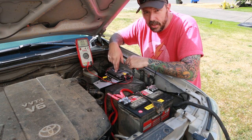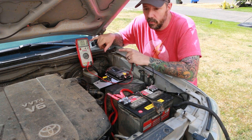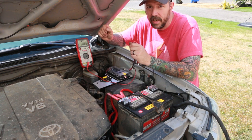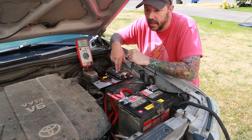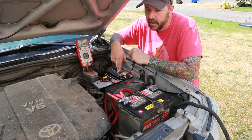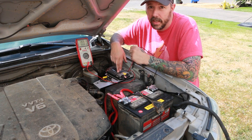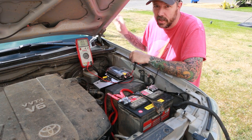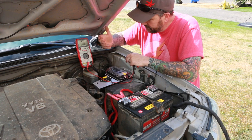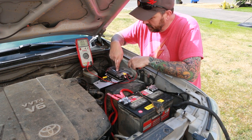I'll set up a negative switch-switching relay — that way I'm running one wire up to the cab to a switch that will be grounded. When the switch is on it supplies ground to the relay; when it's off it terminates that ground. A whole lot easier doing a negative switch relay because you're only running one wire to the cab. It's a pretty easy install overall — the Overland Equipped bracket with the Blue Sea 90 amp breaker and the 12 terminal fuse block.